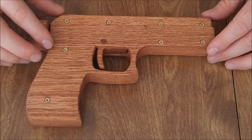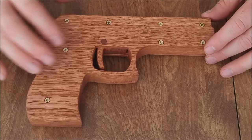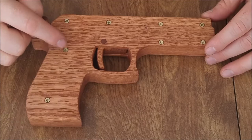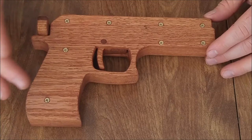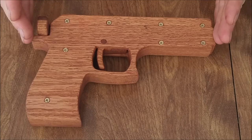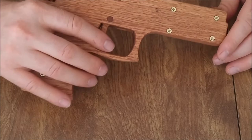This project is called the Bugginator. It's a wooden pistol that shoots regular table salt at small bugs like flies or spiders. It's made of red oak with small brass-plated screws holding everything together, and about three music wire springs on the inside. Size-wise it's about five and three-eighths by eight and three-eighths inches — about the same size as a standard full-size pistol, and physically feels about the same, just lighter.